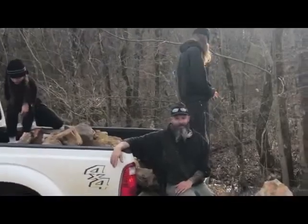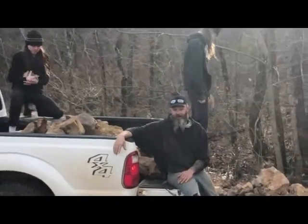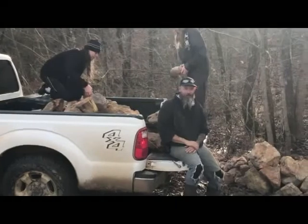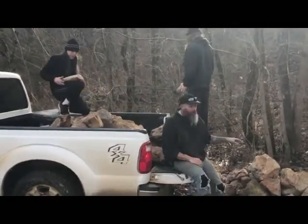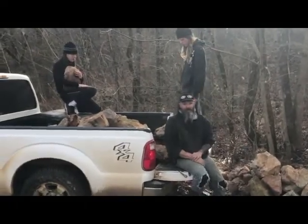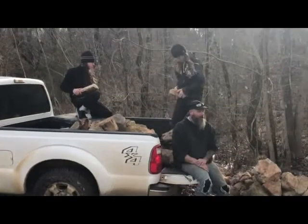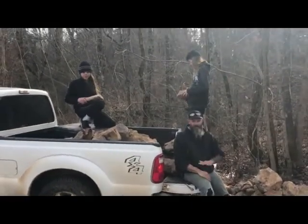So we're on to phase two of fixing our driveway. What we've been doing is grabbing a bunch of rocks. One of the things that we grow really well out here, besides ticks, are rocks. So we've been getting a big pile of rocks, and we're going to use them to fill in the deeper spots before we lay the gravel down. We'll kind of lay a bed of rocks as filler, then put some gravel on top of that, and then some creek rocks on top of that.